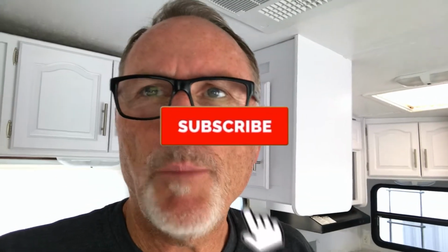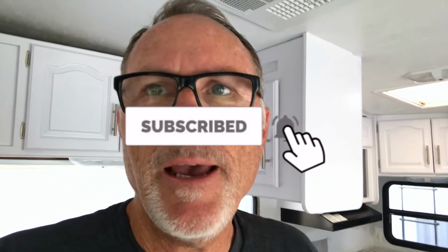Okay, first mistake. These have a direction to them, and I guess I did mine backwards. If you're putting the thicker piece on the bottom, then you have to go right to left. If you're putting the thinner tile across the bottom, then you go left to right. I was putting the thicker tile on the bottom and going left to right. Didn't work. So they have a spot marked overlap here. So it really matters which direction you go.